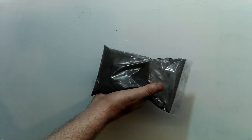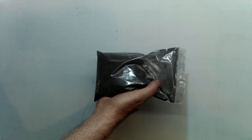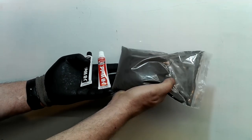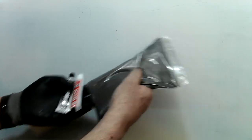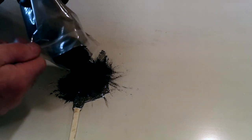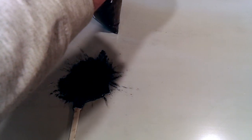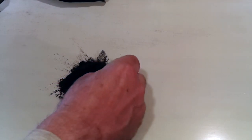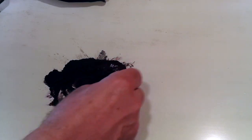But I went a step further and added some cast iron dust to the resin before adding the hardener. Obviously, I didn't know what amount to add at first, so I did a couple of small mixes. One of one iron to one resin by volume, and it was practically impossible to mix all the iron dust before the resin became overwhelmed. So then I did a mix of about one to three resin. The small sample was still difficult to mix as it turned into a thick, clumpy paste. But when the hardener was added to it, it became manageable again.